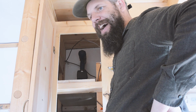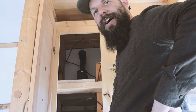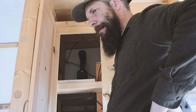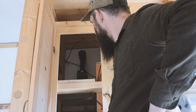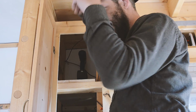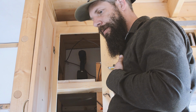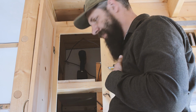I mean, I guess it's fine. That's the whole point of that, is that it is venting up there and it's venting that air all the time. That's exactly what that space is there for. I guess. So I guess if I punch a hole here and punch another hole, push the insulation aside, and punch another hole through the exterior board up inside the eaves, that'll be it. That's how we'll do it, I guess.